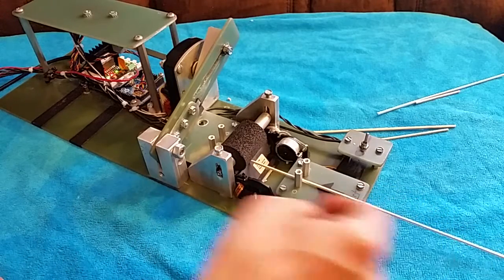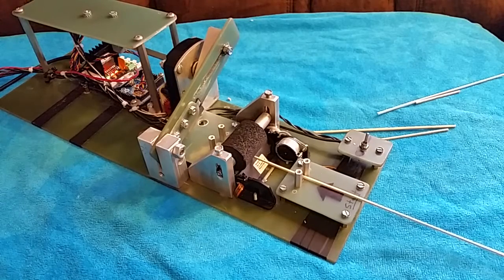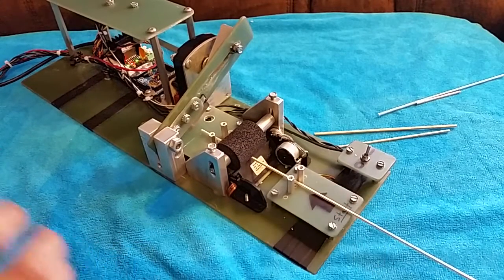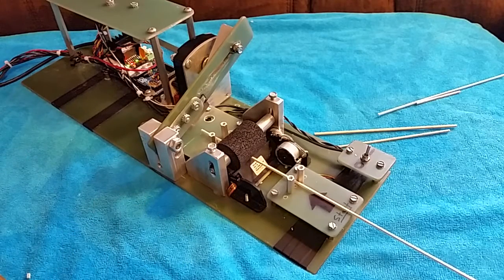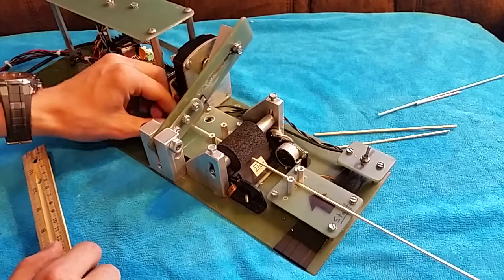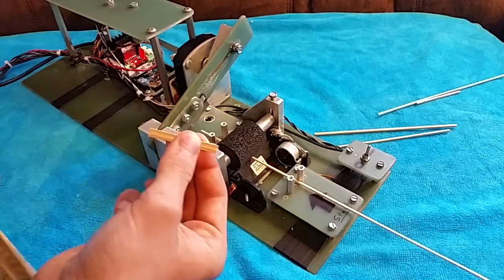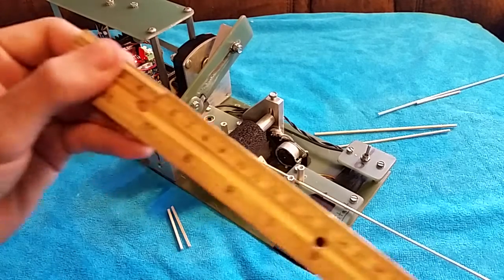I made multiples of that and then made my blade to fit so it didn't cut through my tabletop. For a quick demonstration: we stuck this in the foam just to get it in there, and we type in seven centimeters to get it past this roller and through the blade. Just type in seven and enter — you can see it cleaned off the end. Now we can type in whatever we want.